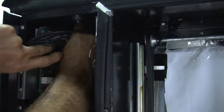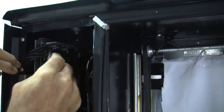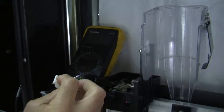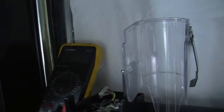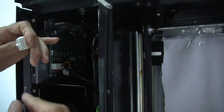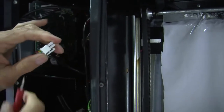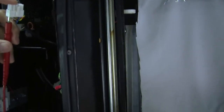The two ends are easily identifiable. There are nine wires in it, each wire has a different color, and both ends will match. Now we're going to zero out our meter, making sure that it works. This meter happens to have an audible tone when there's no resistance. He's going to insert one end of the meter into the back of the plug.